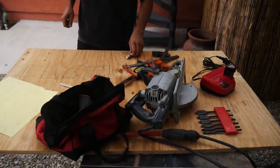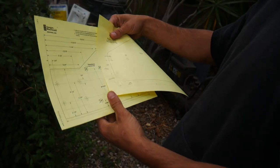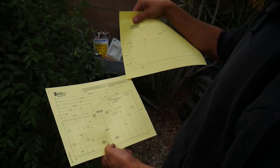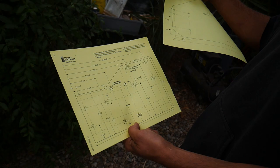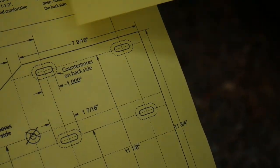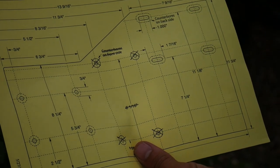I don't think there's a real reason why they have us doubling up except for just having a smooth bottom so you can put it anywhere. The countersinks — how deep do they put those counter bores? It doesn't even say. I wonder if it's because of the weight too, because the motor and the pulley system is pretty heavy — maybe just to make it a little stronger. It's got to be at least the head of an allen head bolt, about five-eighths. There's a slot on the backside for a little bit of adjustment there for the motor so the tension stays correct and doesn't get loose.